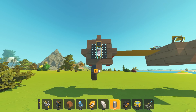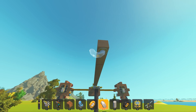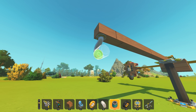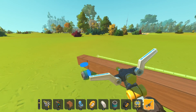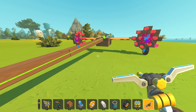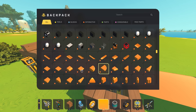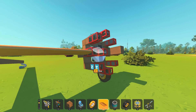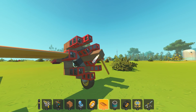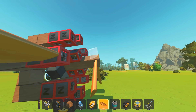The motors are definitely more powerful than the previous ones, but it concerns me that the encoder offset is different from what we tested. On the dyno we got 300 RPM in this configuration versus 1300 RPM in the other configuration. It's strange how much the torque changes under load versus not - let me know in the comments if you have more dyno testing experience. This motor spins outwards so we need the prop to face in that direction.